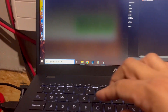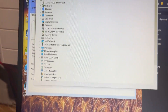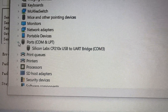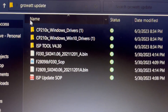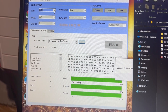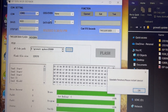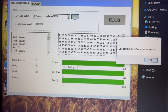I'm doing this with my phone. Go to Device Manager once you plug your cable in, and under Ports it should show Silicon Labs. If it's not showing that, you don't have the driver installed — install it first. For Windows 10 or Windows 7, just install that driver. Then start the ISP tool program, which is currently version 4.30. Once it's open, go to the COM port dropdown and pick COM3 or whichever COM port your cable is connected to, then select the path for your firmware file.